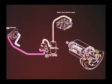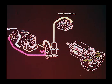The flow priority is directed out of the top of the valve body through the 10-micron filter and to the transmission control valve mounted on top of the transmission case. The hydraulic PTO clutch is also supplied with pressurized oil from the transmission supply circuit.